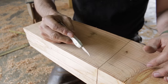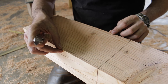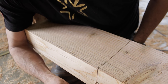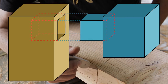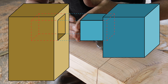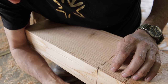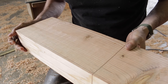So you can see here that I've got this line. We need a six-inch tenon, and this was actually six and three-quarters, so there's three-eighths going to come off on both sides. That's going to give us — I forget the terminology, but I think it's a housed tenon — anyway, it'll have a shoulder on it that butts up there, so it'll look like the wood just comes together. Only way you can tell it's mortise-tenon is from the sticking out the other side and the doweling. It's a good way to do it and kind of mandatory here, or I'd have to take all this material down. There's more than one way to skin a cat.